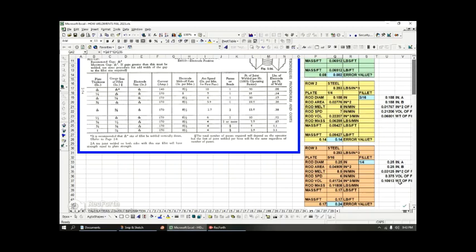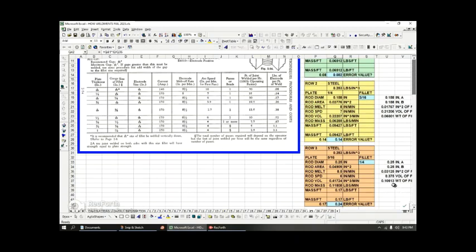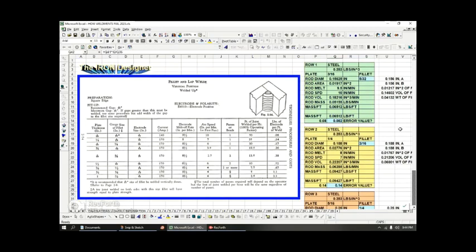And what this is, I thought maybe I was making a mistake, that I need to calculate the volume of the fillet instead of the volume of the welding rod. And it also didn't really change anything. So these are my values here, because I thought maybe what they're talking about is pounds of electrode per foot of weld when they're talking about the fillet weld, and that didn't really come out. So it is maybe talking about pounds of electrode, not pounds of fillet weld.